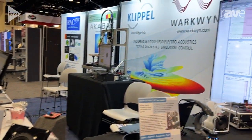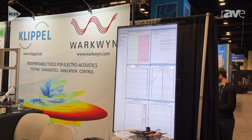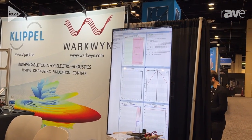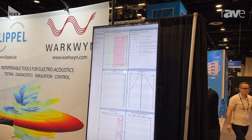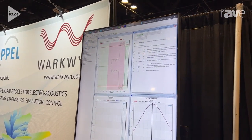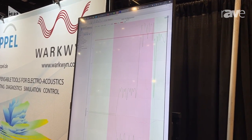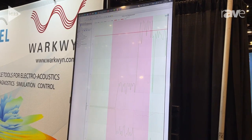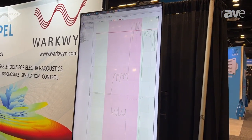I'm now turning on the KCS algorithm. We get some really good bass now, undistorted. And here we can make sure that the voice coil displacement — which is synthesized just based on voltage and current — stays within the displacement limits that we set for this speaker.